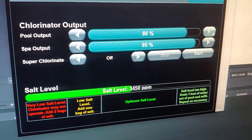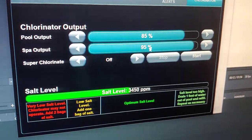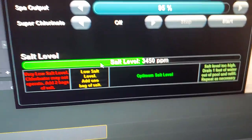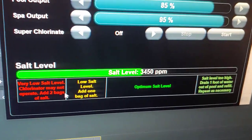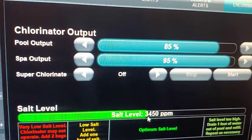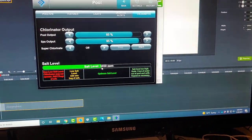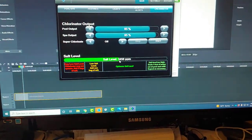I'm going to put it on 85% — I had it at 100% to see if it would make chlorine at all the other day. I run my hot tub for a shorter time during the day just to circulate it, so I'll leave that one high. As you can see, my parts per million is already registered at 3,450. You can make these adjustments anywhere on your phone app or PC app to determine whether to add a bag of salt. Mine is sitting right in a sweet spot. This has been an overview of the saltwater generator for Pentair systems, but for Hayward, Jandy, and anyone else, I hope this has been useful too. Please like, share, and subscribe — thanks!